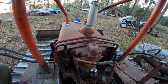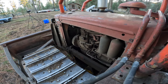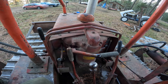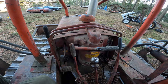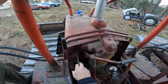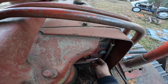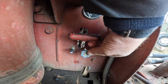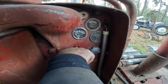As you saw, one side of the engine has got gasoline fittings. The other side has got all your diesel injector pump and all that business. This lever right here opens up a valve in each combustion chamber that lowers the compression in the engine so that it can be started on gasoline and spark plugs. We have the decompression lever down, we have the diesel throttle down. There is no throttle control on the gasoline side of things, however there is a choke. Since it's cold, we'll give her about half choke. And this right here is the starter — we'll engage that and see what happens.